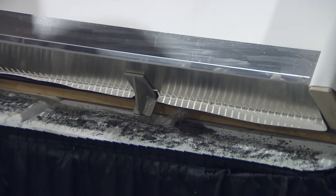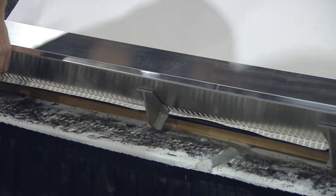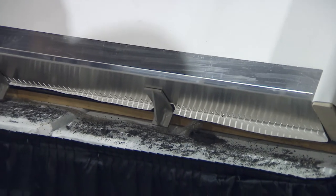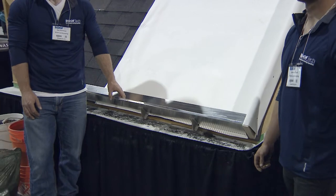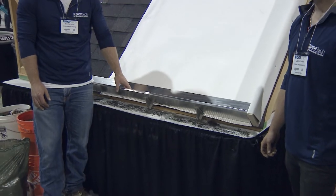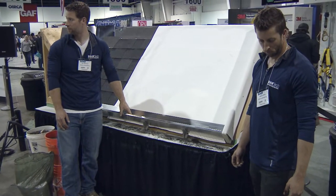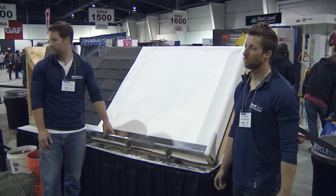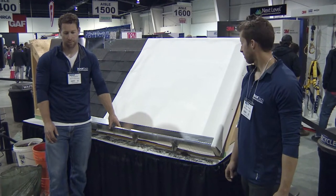The second critical element is soil retention — only the soil wants to erode or slide down to the lowest point. Anti-erosion measures need to be in place to keep everything on the roof. The third critical element is drainage — water falling on a sloped roof will all collect at the bottom, so it must drain off quickly. For this reason, a root-protected waterproofing membrane is recommended rather than a flat root barrier, which is slippery on a slope and difficult to work on. The roof also cannot be installed on shingles, as there are too many seams for roots to penetrate.